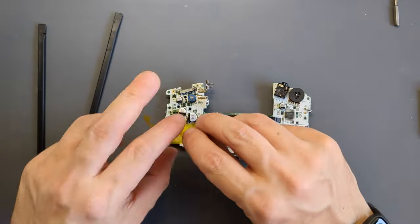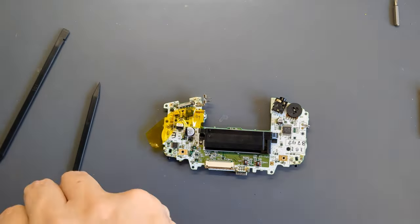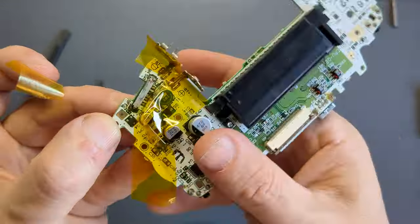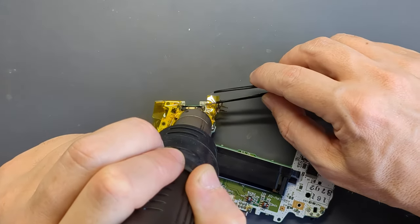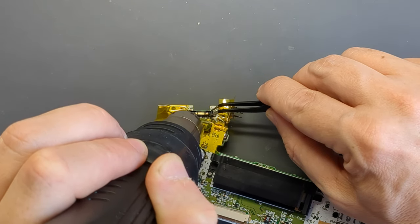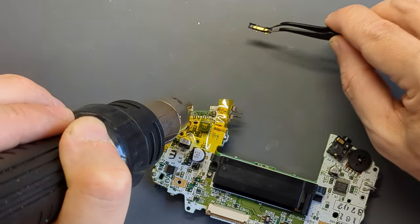There are a number of ways to remove the old switch. As it was a bit messy already, I decided not to go prodding around with a soldering iron this time and used a heat gun instead. If you're using a heat gun, you'll want to avoid any damage to the surrounding components, so I masked all of these off with some Kapton tape, which is a thermal and electrical insulator and a quick way to protect the parts we don't want heating. I set the heat gun to a high temperature around 300 degrees and set a low airflow to keep the heat contained in a specific area. Once the solder showed signs of melting, I gently lifted away the switch with tweezers, being careful not to be too eager and tear off any solder pads from the motherboard. Thankfully, that all went smoothly.